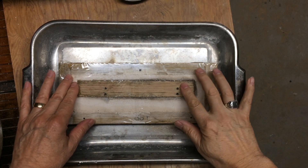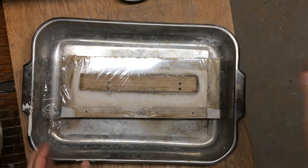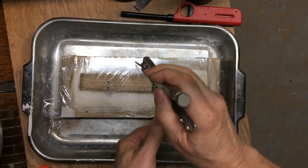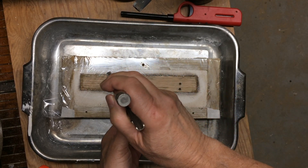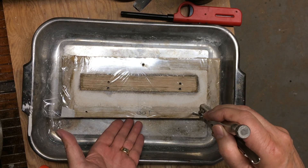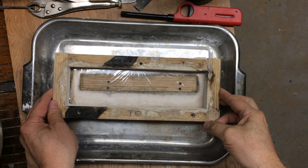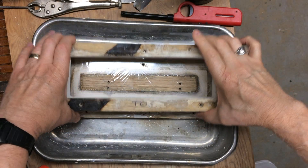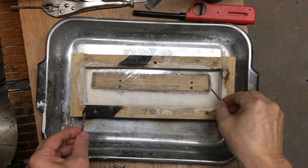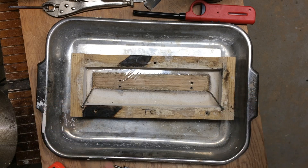Here I've placed the pattern in the bottom half, and I put some saran wrap over the whole thing and taped it together. Now I'm going to put some holes in it for the screws. I've heated up the tip of a nail to pierce the plastic and make holes for the screws — I find that doing this prevents the saran wrap from getting tangled up in the screws when tightening. Now we can put the top half of the mold on the bottom and prepare to build it. I'm going to align the holes, and place a couple of nails in the corner here to make vent holes where the hot metal can vent up through.